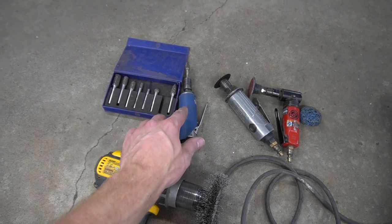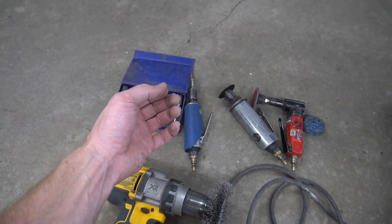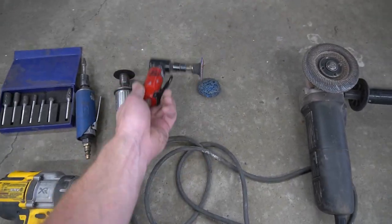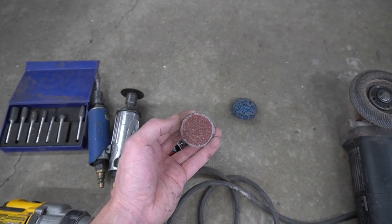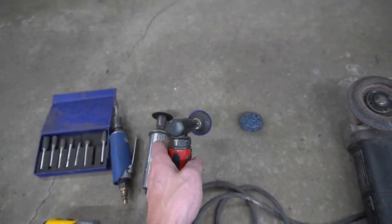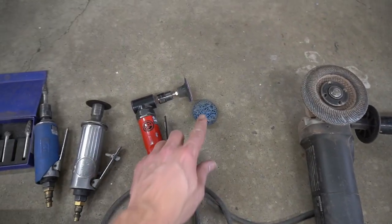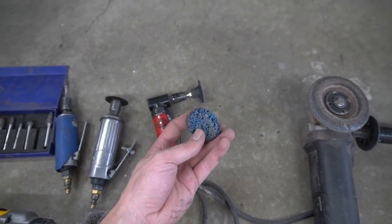Just make sure you wear your safety gear because it sheds metal like crazy. I even got some in my gloves and it started cutting me. So it's an awesome tool, but definitely wear your safety gear. Next, I use this a lot — it's just an angle die grinder with a two inch disc on it. I use two inch and three inch sanding discs. When I use the three inch sanding disc on the two inch backing plate, it gives you a little bit of flexibility so that when you're in the corner, you can take that three inch disc and kind of ride these curved areas. It makes it nice and easy. And if you've watched my other videos, you know how much I like these — these are the Blackhawk strip discs and I have a video on these which I'll link to above.